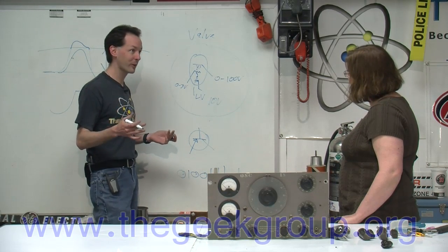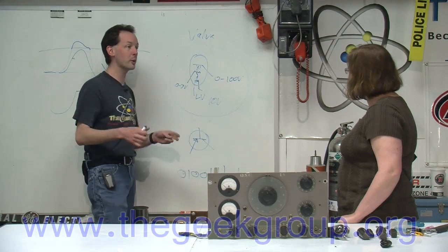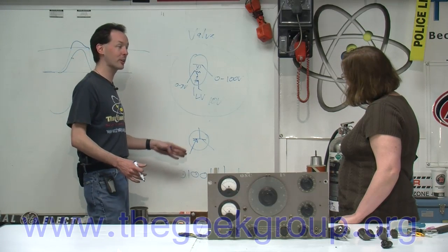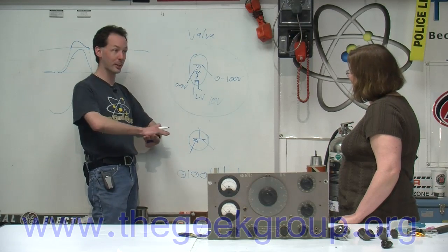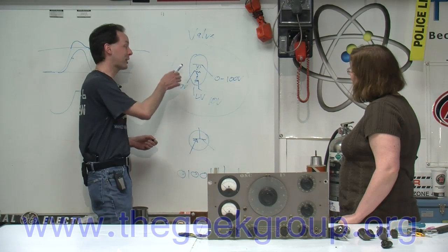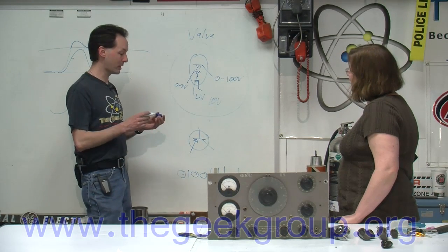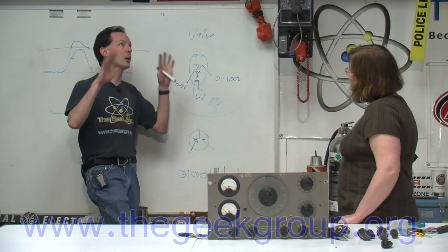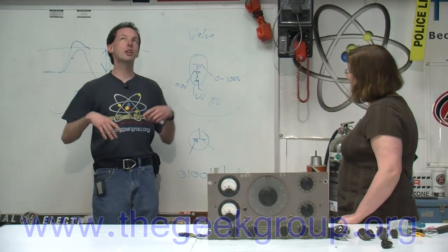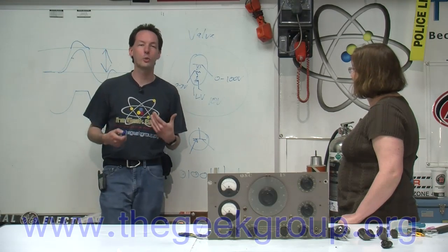The shape of this knee dictates how pleasing the distortion is, and the distortion gets progressively worse as you get progressively better — the music has gotten more accurate, the amplifiers more accurate. This is where you get the holy war. This system is better than this system as far as reproducing the accuracy of the original input signal — the solid state amplifier is more accurate to the original sound. You cannot argue this. But when you overdrive it, the tube amplifier sounds better. That's the trade-off. When people start using words like 'airier' or 'crisper, cleaner sound' — give me numbers. You know you're wrong.